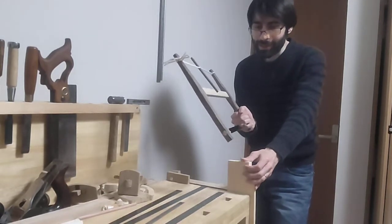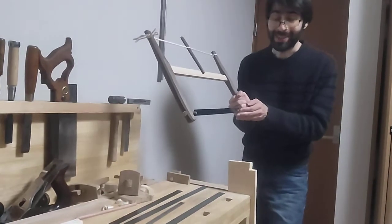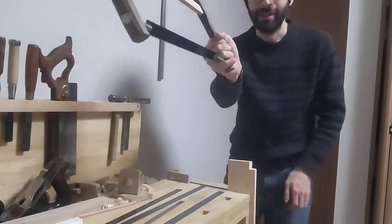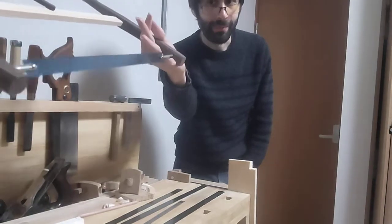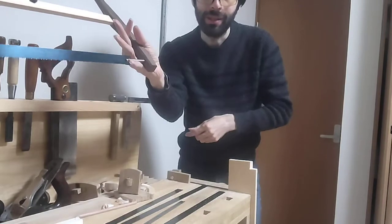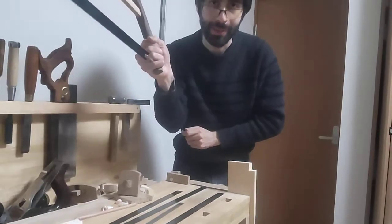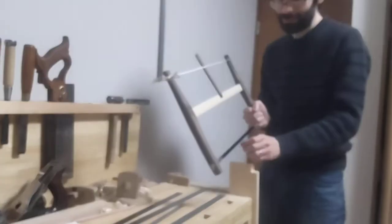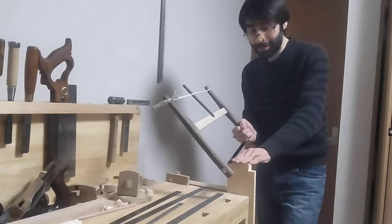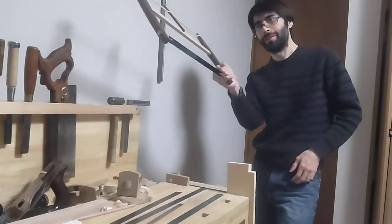And the other thing is, I forgot to mention, a unique point of these Chinese style bow saws is the way you hold it. If you look at the way I'm holding it here, you have a rather long bolt, and one finger goes underneath, and the other 3 fingers on top. What this allows you to do is really control the saw very well, and it also allows the force to be more in line with the stroke.